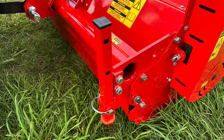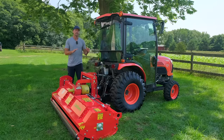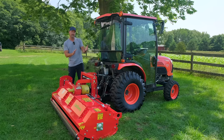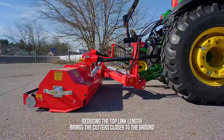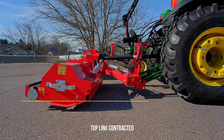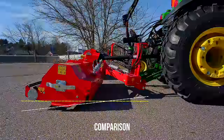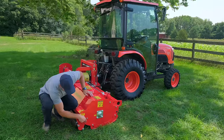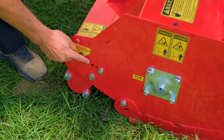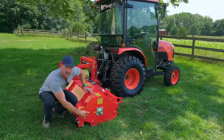You still have a built-in parking stand up here. You're going to have two ways to control cut height. The first is with the top link — if you extend it out, it cocks the whole thing back and raises the height of cut; if you shorten it, it lowers back down. The other way is with the roller. We have to adjust this before we start mowing. We're in the low setting right now with these two bolts holding the roller in place. I'm going to move the top bolt over, rotate it, which puts the roller down further and raises the base cut height a bit higher.